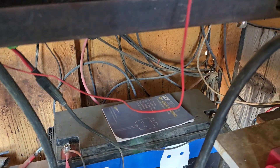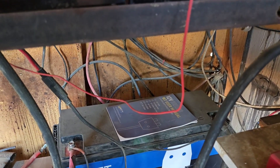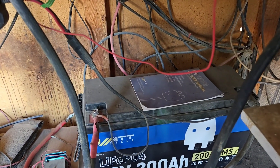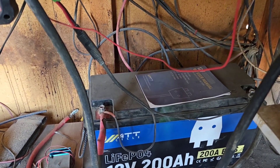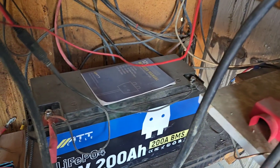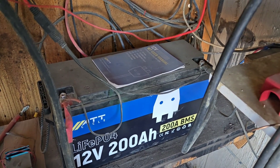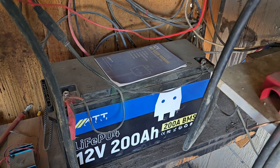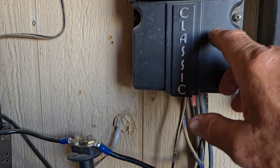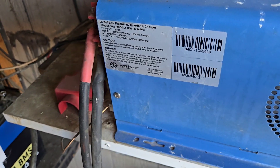In parallel you can connect more than four. In fact, most LiFePO4 batteries will let you go up to 16 in parallel. But there's a problem — if you're going to go with that many 12-volt batteries in parallel, you're not going to find even an all-in-one that will handle that power, because they don't make them.